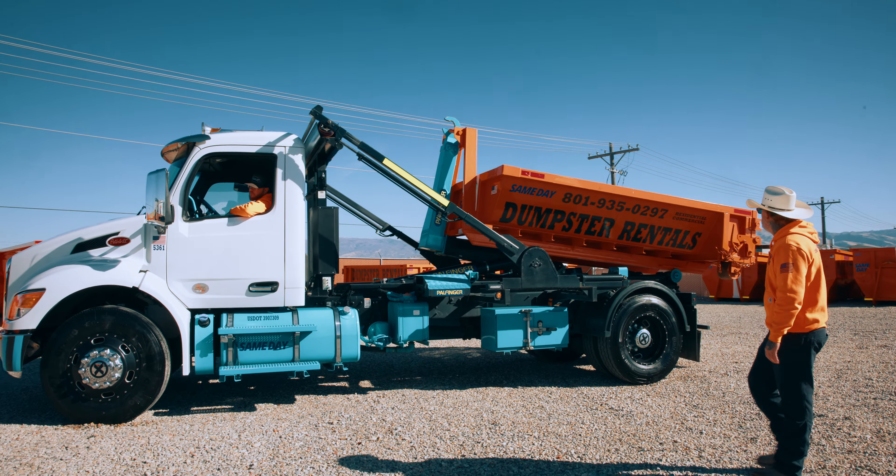As this is lowering down, that bar fits nicely in the hook — but remember, this is a two inch bar. Now I'm going to show you the difference in what a two and a half inch bar looks like. This is a Matcorp can with a two and a half inch bar that has all the right angles on it. When it slides down in the hook and is in the travel position, you'll notice how much better a two and a half inch rides down in the bottom part of that saddle compared to a two inch. Look at how much tighter that is on the bottom.